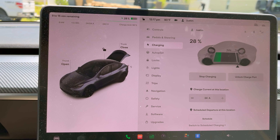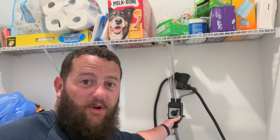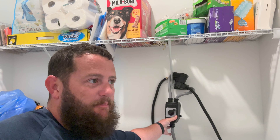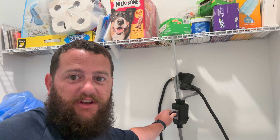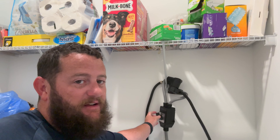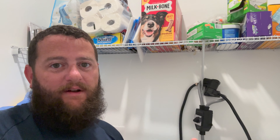This is going to be a good temporary solution. It's now been five months and we've had this hookup for five months. I actually added a switch shortly after I did the install. It's not a smart one — it's a very simple switch — but it means if the dryer is not running, there's no power going to the car charger. You just switch it between setting one and two. It splits that power into two different sources and only one can get the power at a time, so you don't have to worry about tripping the breaker. Definitely worth getting this splitter.